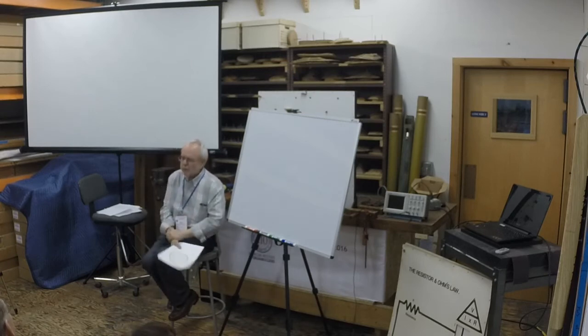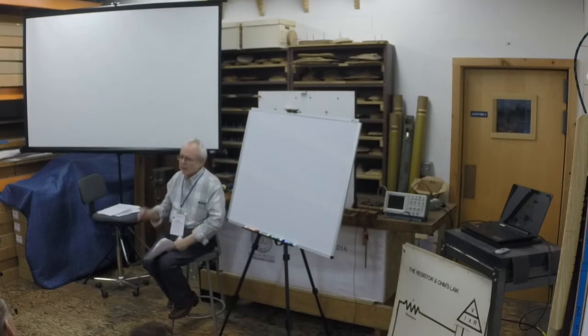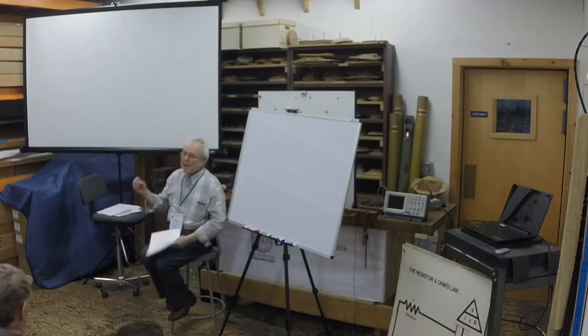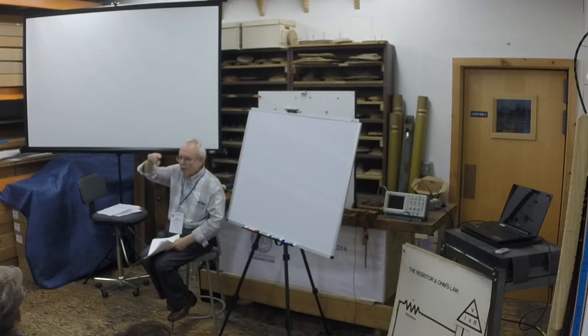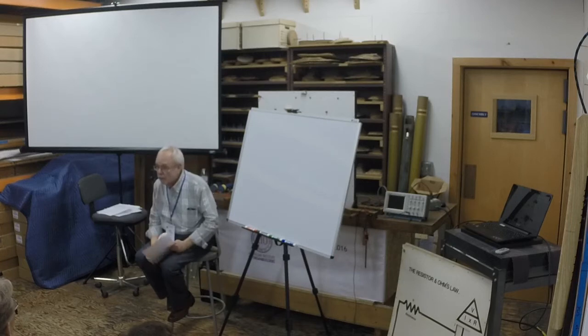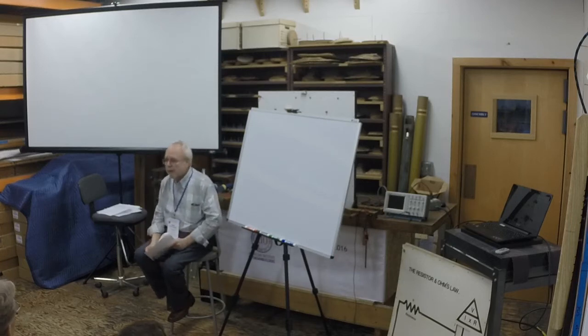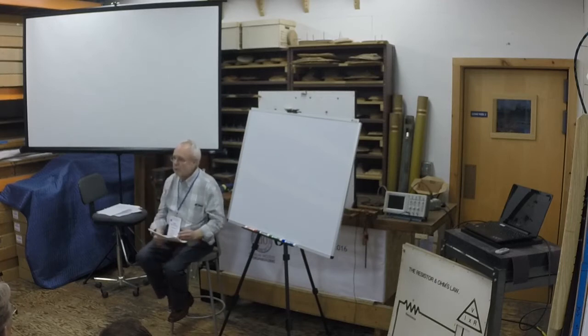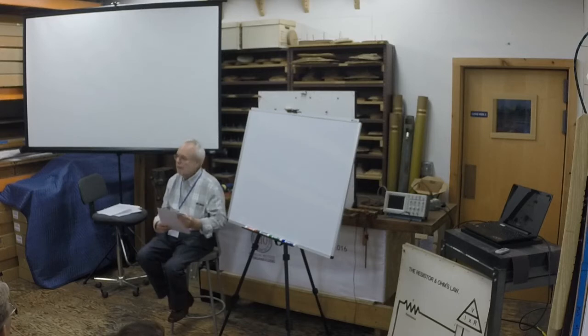And I think in a class once I was told that the electrons tend to flow... it's called the skin effect. Skin effect? No, it's nothing dirty, guys, really, truly. The electrons tend to move along the outside of the wire, and so there actually may be an advantage to using, say, three number 14 wires instead of one number 10. These are just off-the-cuff numbers.